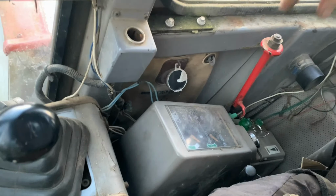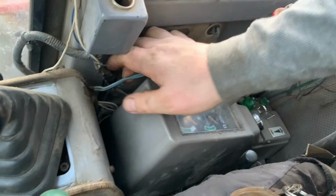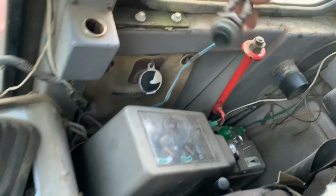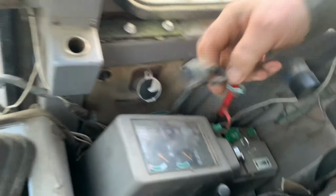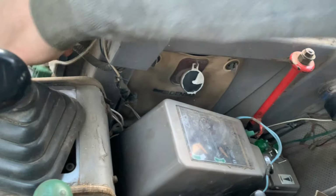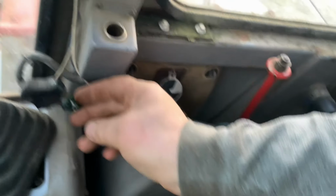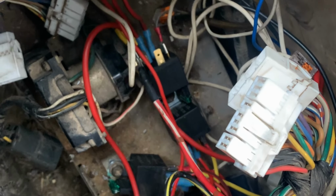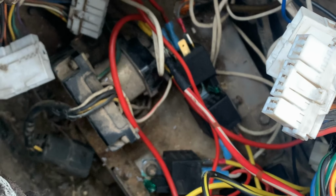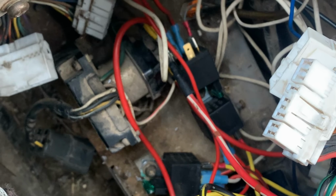To the electric bits. There are several afterhand fixes. This is the start button, it's a loose button. Want to integrate that in the panel. This is for the light. Well, it's messed up. Two relays for the hydraulic. I also fixed a relay for the lighting that was shortcutted with only a switch that overheated, so I put in a relay for that also.